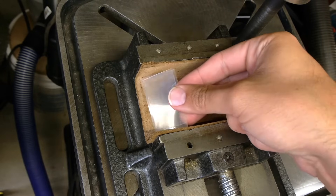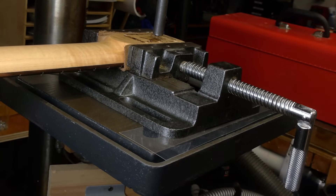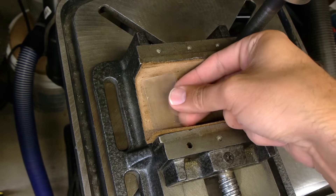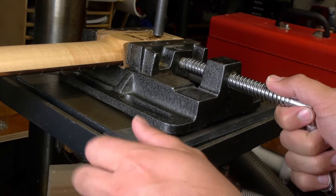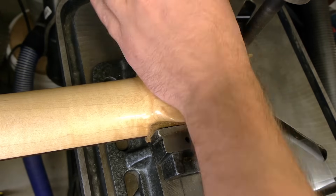Now, where to place the shims — under the neck heel itself, or under the base of the vise? The answer is both. Shim for the x-axis under one of them, and shim for the y-axis under the other. Because shimming either axis on one object will create a wedge-shaped gap on the other axis of that same object, meaning the shim will only contact the very end of that wedge — not stable or accurate. But if you put a shim under the neck heel, the drill press vise is still flat, and vice versa. Shimming one axis on one and the other axis on the other guarantees stable, simple, and accurate shimming.